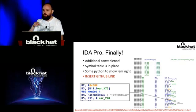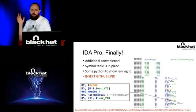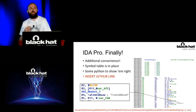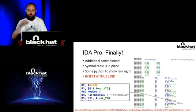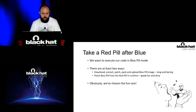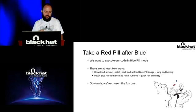It's a binary blob which stores settings, yes, no, yes, no, for licensing. It's kind of the main configuration of main features, such as data bandwidth, handover capabilities from macrocell to the femtocell, and so on. So, kind of analysis. Actually, we wanted to execute our code in a blue pill mode. We didn't want to always stay in this debug interface, the bootloader.